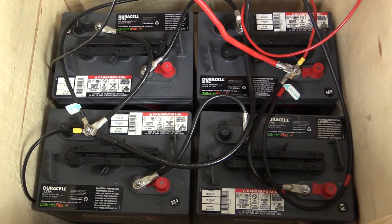In closing, when making a decision between a PWM and an MPPT charge controller, note that there's no real advantage with going to an MPPT charge controller in a single panel system. If you have multiple panels, then you have to weigh the cost versus the benefits. If you want more efficiency, if your panels are far away and you want to save money in wiring, then the MPPT might be right for you. Once the power hits the controller, it heads down to the batteries. In the next video, we're going to take a look at storing the power and the battery box.